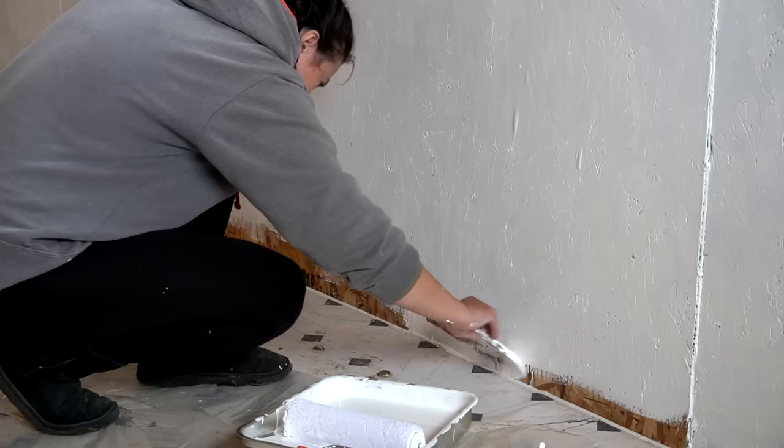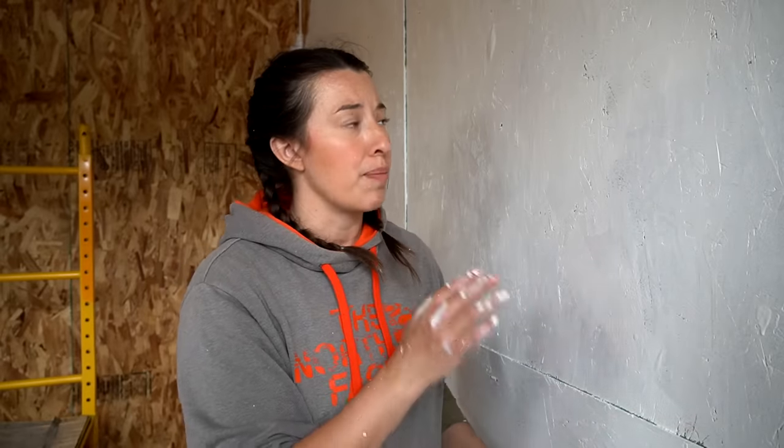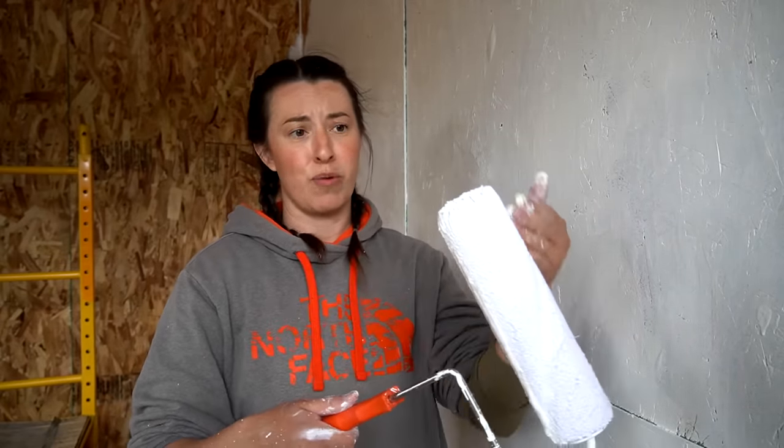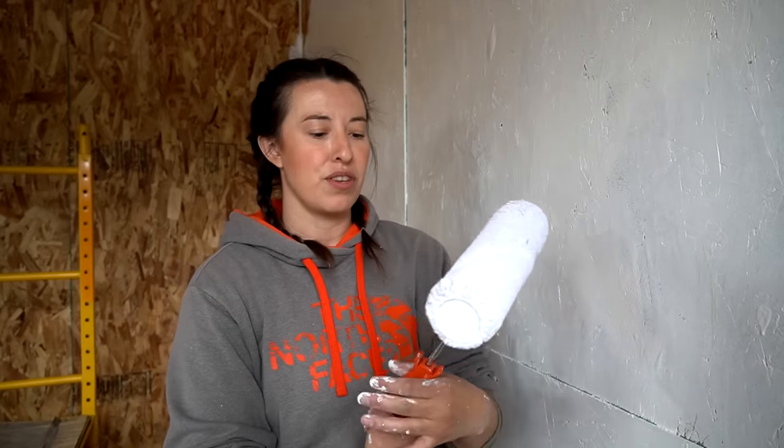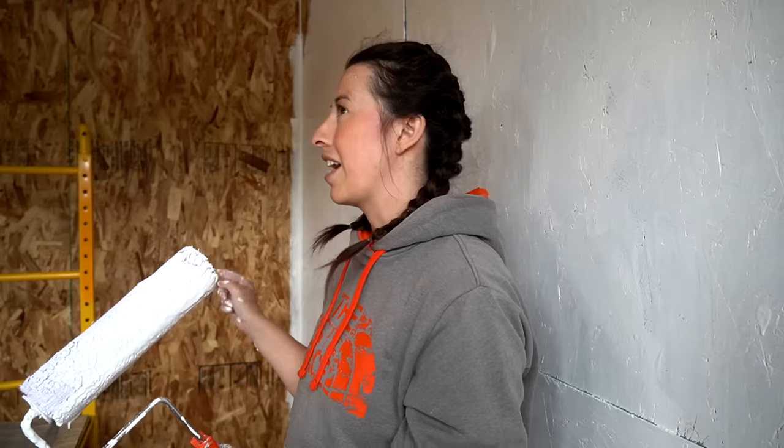I waited to paint along the bottoms until last because it's very dusty in here. We took the straw out, but since we caulked the floor just yesterday, there was already dust along it, so I just wiped it out, cleaned it off, and got it painted. I have the ceiling to do, which I'm probably not going to do by myself. We have to do two coats since it's a light color, but so far I'm pretty impressed - the paint's getting good coverage. We used the shiny side of the OSB with a roller meant for semi-rough surfaces, though I'm having some trouble with it falling off - I'm probably using it incorrectly. We've got some special plans for the back wall, so we're not painting that just yet. I think I'm going to get started on my second coat.